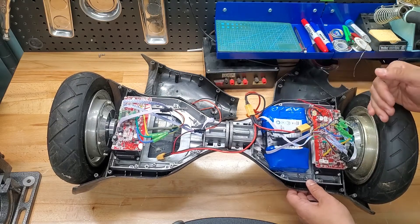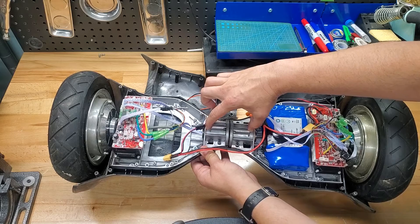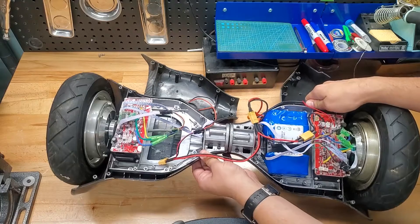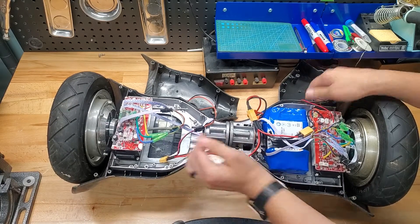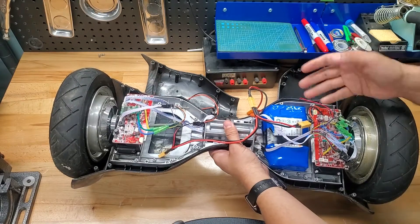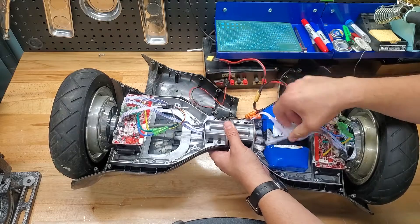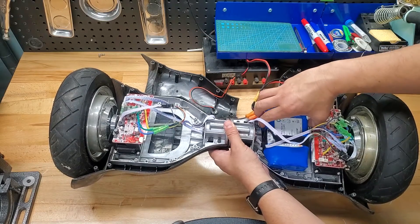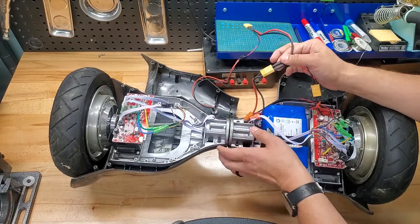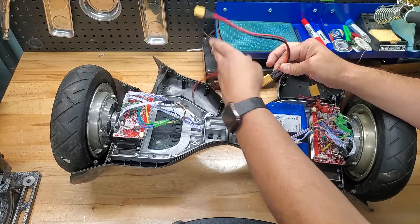To give my robot a narrower wheelbase, I took a saw and chopped out the four inches or so where the pivot is, since I didn't need that feature, and was able to squeeze the frame a little bit closer together. Also inside you'll see the battery pack right here — it's usually under a little frame to hold it together, but I have that already removed. It gets attached to one or two control boards with a connector and off to the charging port.